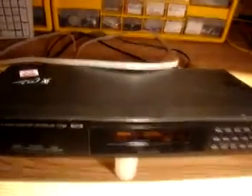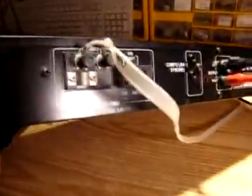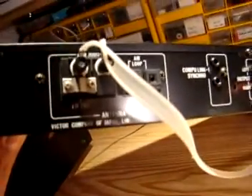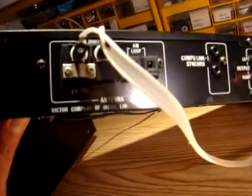So this is the way it is right from the store. What I'm going to do is put a better antenna connector on the back. Here's the back — very simple receiver. Got the tuner, the twin lead, and for coax they just have a little clamp. So what I'll do is put an F connector on either side. And since it is so sensitive, I'm going to put in a switch with an attenuator so when I put it on the big antennas up on the roof I won't overload the receiver.